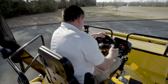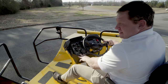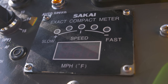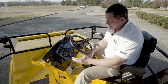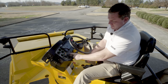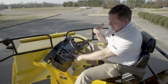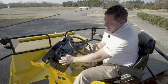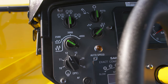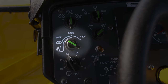I'm going to rotate this side and we're going to take a look at Sakai's exact compact meter. This matches your speed, frequency, and vibration so you ensure maximum compaction. It will tell you if you're too slow, or right on in the middle, or if you're too fast, and you can adjust accordingly to ensure maximum compaction. You're going to have three frequencies: 2500, 3000, or 4000 vibrations per minute.